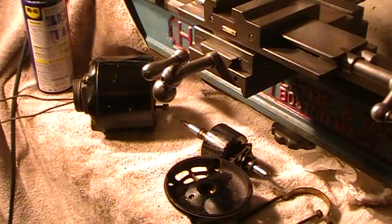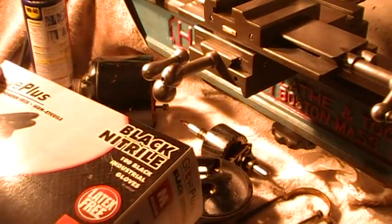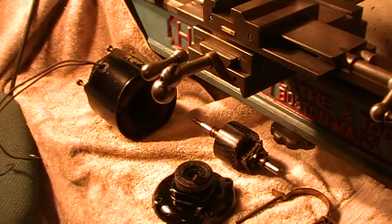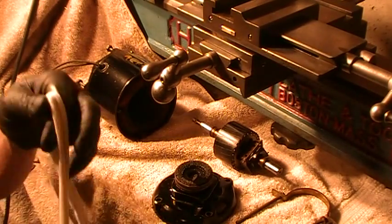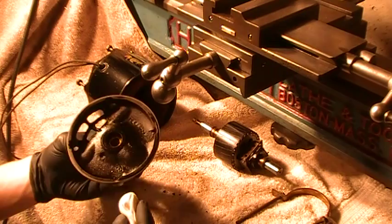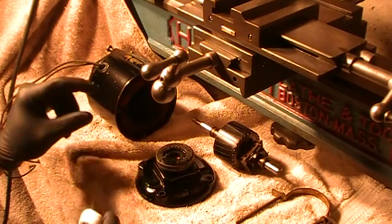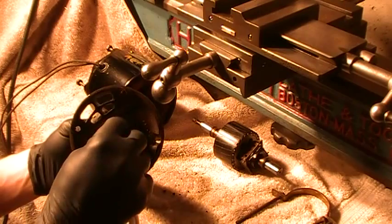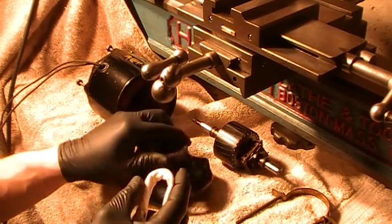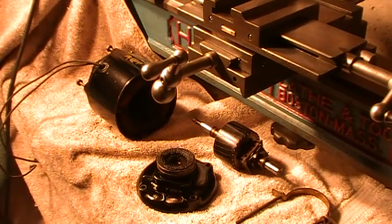Just random tips — there'll probably be some more. I took a break, went to Ace Hardware, got some gloves. Going to put some gloves on and continue — better for your hands. Another quick tip: to take any crap you might have gotten in the bearing when cleaning the motor — to get any dirt out, just take a piece of cotton t-shirt or something that won't scratch up the bearing. I would not use paper towel because the little fibers come apart. Just run it through there — stick a pencil, run it through there. If it's a blind bearing, meaning you can't get to the other side, just wad it up in there, turn it, pull it out, turn to a clean spot, and repeat.